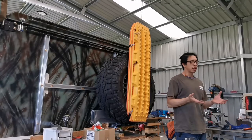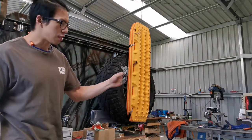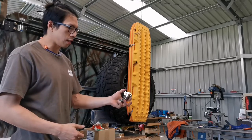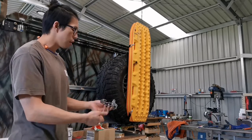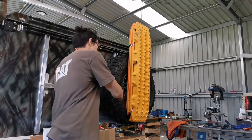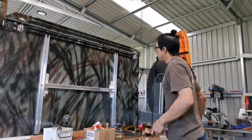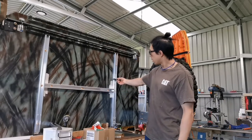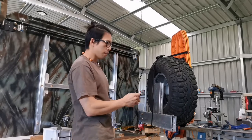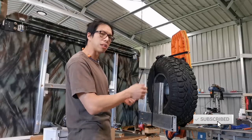Well, the next step really is to make a latch. This is called a rotary latch. As I showed you earlier, it is controlled by this movement. So there is a bar that comes onto it and it catches it. So that's going to sit, I'll show you. Okay. Now this is going to sit on somewhere here. And as the wheel carrier comes in, that basically is a mechanism that catches the wheel carrier and it eliminates the swing.